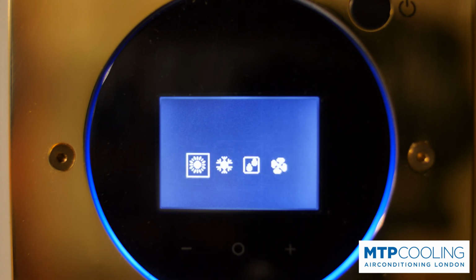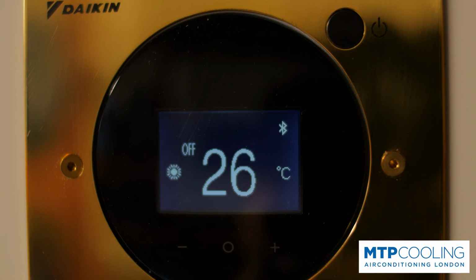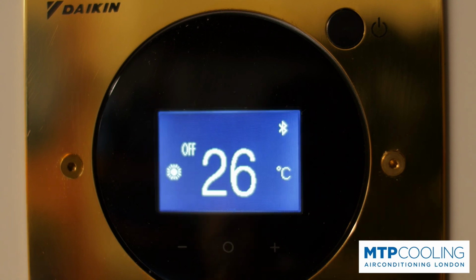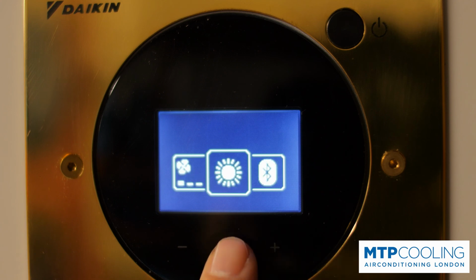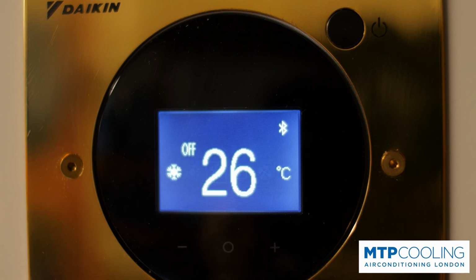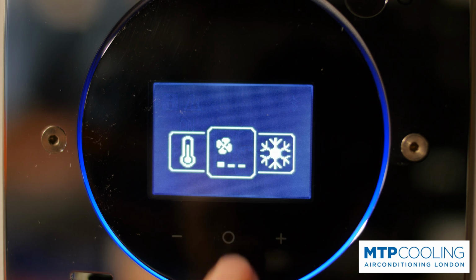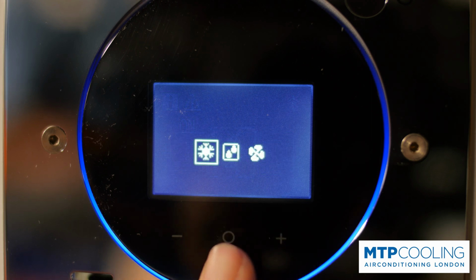The next selection is your mode. Normally you would see 4 modes, and that's heating, cooling, dehumidifier, and fan only. Once you select the required mode by using minus and plus buttons, you just press the middle button to confirm it. If it happens that you have more than one controller on your system, only master controller will have all 4 modes. All the other controllers will only have the fan only and the selected mode. So if you go to the controller and it doesn't show 4 modes, then you need to find the one which does, and that will be your master controller.